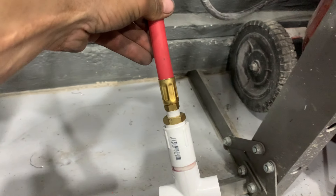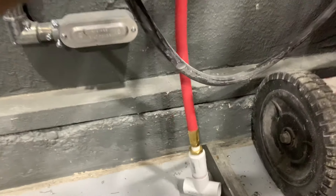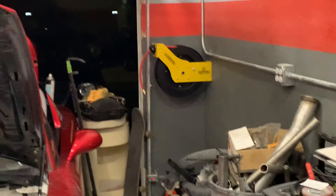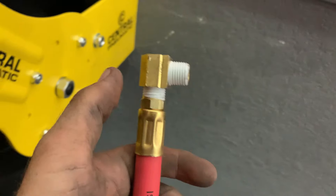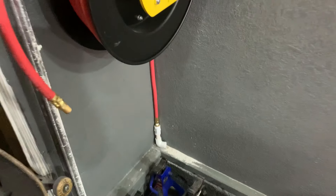The compressor side is done — it wasn't that big of a deal. All we had to do was glue the T on and put all the fittings together. It's plugged into the compressor, drops right down here, and will distribute the air supply to the left and also to the right. For the hose reel this one requires a 90-degree fitting. I put the 90 like that, then drop the hose down where it comes into another 90 to go across to the air supply. I wanted to drop it straight down at first but it was too long, so I made it go directly across and it came out perfect.